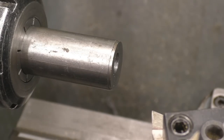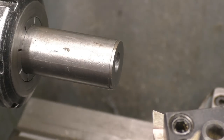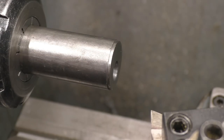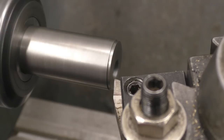So I've got a piece of suitable stock in the collet chuck. All I'm going to do is machine the end flat. It's got a hole in there — it doesn't matter about that, it's just a piece of scrap stock I found. So I'm going to face the end using the right-hand knife tool.